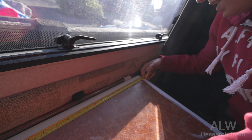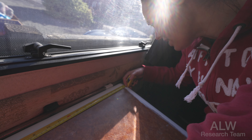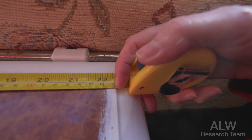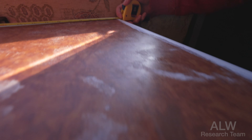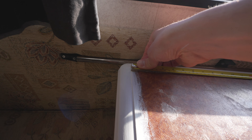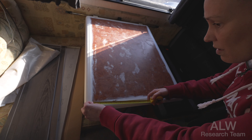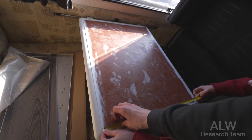So that's like 57 - it's about 57.2. Let's check out the quality control of the 1998 Swift. This one looks exactly 57, I think. So we're two mil out - it's about 0.3 on that one. We'll go on 57.2 because that's easier to divide. 57.2 divided by two is 28.6. So the center line left to right on there is 28.6, and a bit on this end because it's one mil out - half a mil out. So we're working to a tolerance of half a millimetre.